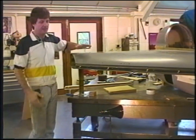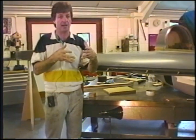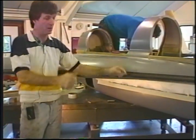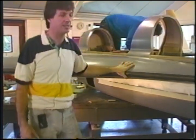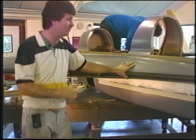What you need to do is make sure that you reproduce whatever occurs on one side on the opposing side. That can be done if you put the airplane together symmetrically at the same time, and you can control these points with pieces of wood down to the floor and then checking with the water level to make sure that they are the same. We're working the other direction. We've started by bonding together one side so that we can, in a timely fashion, get this stuff on videotape while the other guys are catching up.